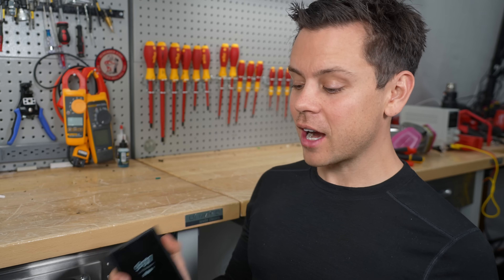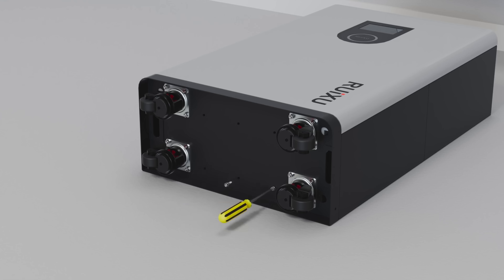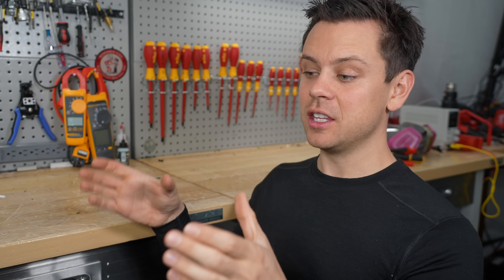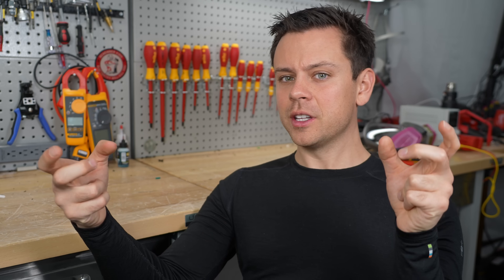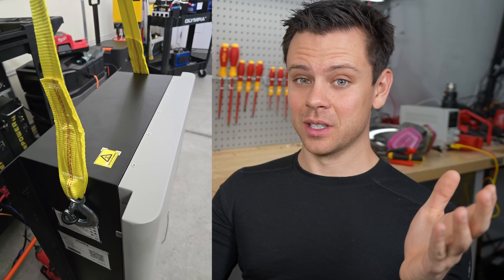First downside: the wheels are very dangerous — remove them no matter how careful you are. Even I toppled it going very slowly, and that's 320 pounds. If that lands on your foot you're going to be in serious trouble. The wheels are connected with a bracket to the bottom; remove the bracket and wheels and then use a hand truck instead, or use the lift points on the sides with a rope or chain — that's the best and safest method.